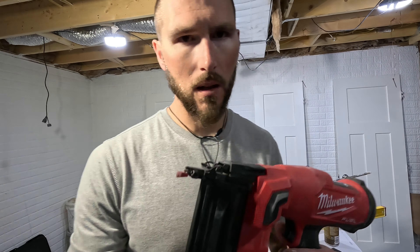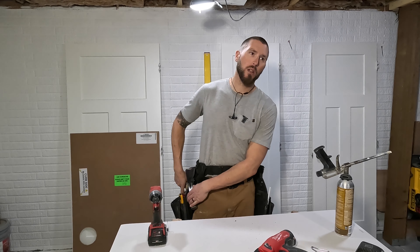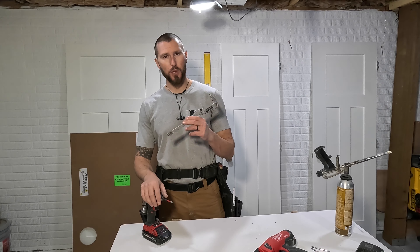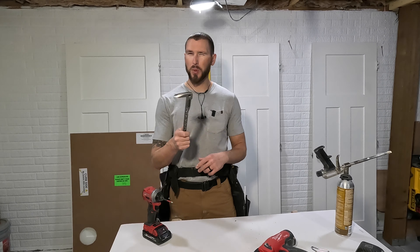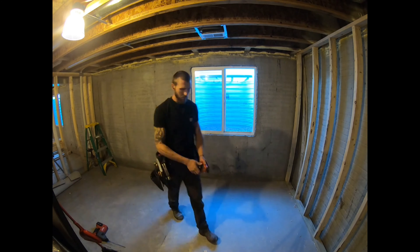When finishing a basement, I recommend buying yourself a tool belt, even just a cheaper one. You're just so much more efficient when marking and measuring with a tool belt — you want to carry a speed square, tape measure, and pencil on you, as that increases productivity a lot. Tools to keep on your person: a good carpenter's or utility knife, your framing hammer, and a torpedo level for when you're building bulkheads. You'll also need a good chalk line for snapping your lines for plates and long runs. When doing drywall, use two colors — red for your layout lines and blue for when you're cutting your drywall.